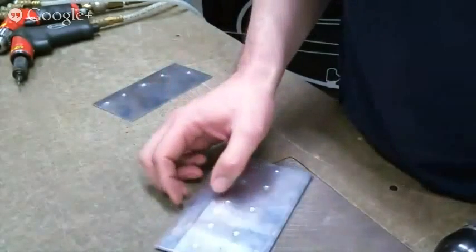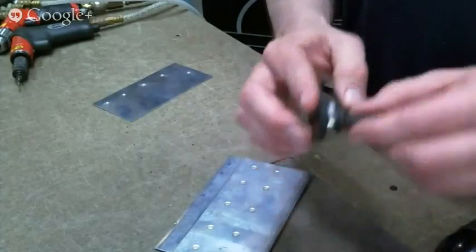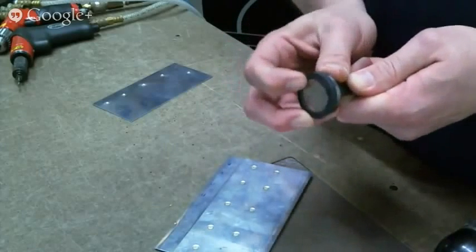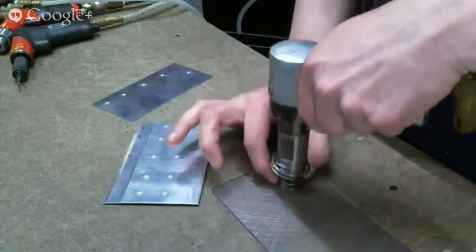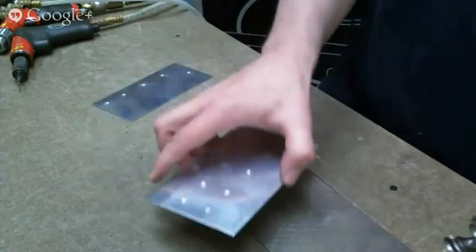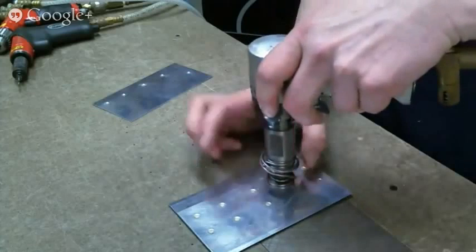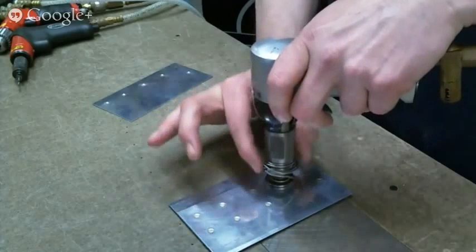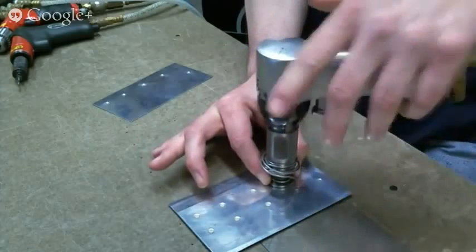And then there is one in between I'll just mention real quick that is a rivet set with a rubber guard but does not have a swivel. So same problem, you'd have to push so hard to collapse that rubber. I wish there was a good way to show this on video, but you have to push so hard that you're really pushing too hard. You should only be holding enough pressure to keep the rivet set on the material. And that leads into the next thing I wanted to show. When you are riveting, you put the set down on the material, and then you should pinch it with your thumb and index finger, and then push down on the material itself. So you're capturing that set and not allowing it to move. So you're doing what the rubber set is doing, you're just doing it with the other hand.